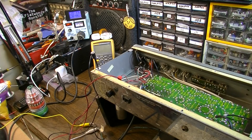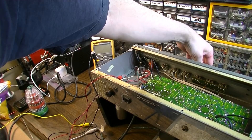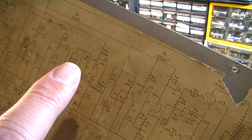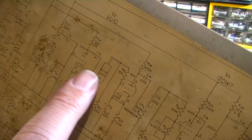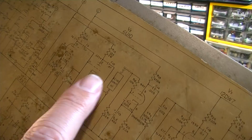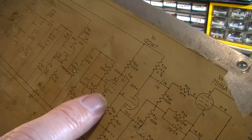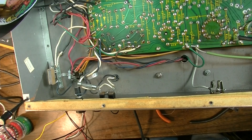The reverb unit — there's the tank. It uses two of the triodes from the 6U10: this triode and this triode. The signal splits off here, goes through the reverb, and then joins back up with the 12DW7. I forget which of the triodes is the weaker one, but it's probably the one they're using for the phase inverter.